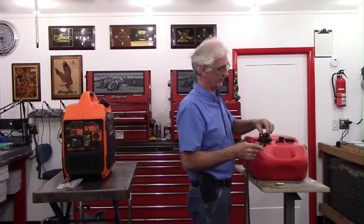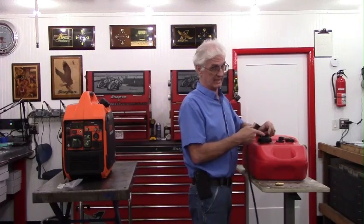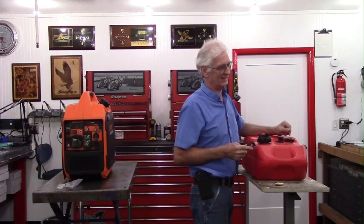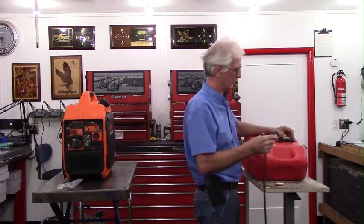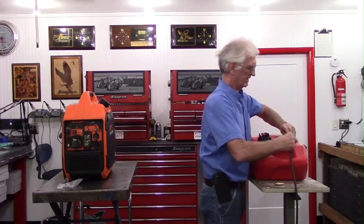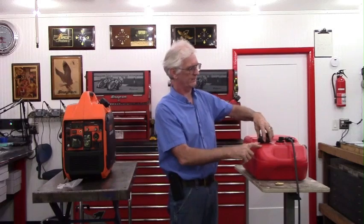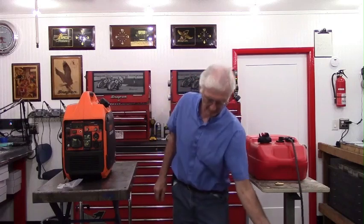Your vent's not working if that happens, and you'll need to run the generator with the fuel cap cracked open. I do see a lot of these vents fail. The manual vent, like this one has, fails a lot less often. The automatic vent ones have close to a 60% failure rate, which is atrocious. At any rate, you'll snap this fitting onto the tank, and because I have the fuel cap loose, it didn't spray all over the place. We've got the fuel tank vent open.